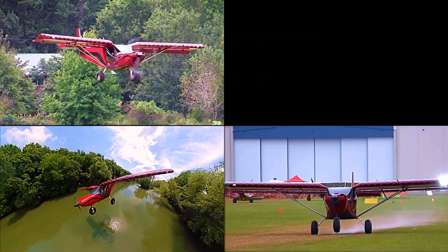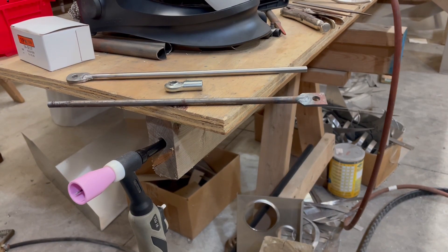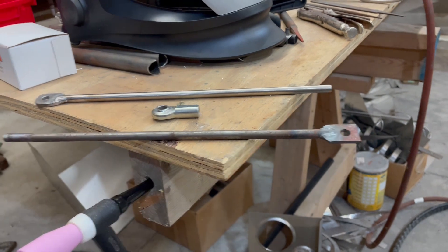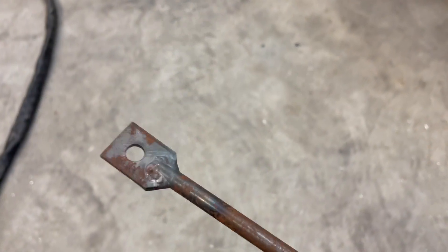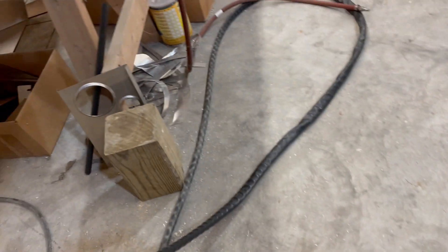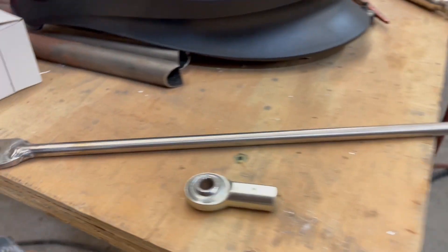Anyway, this specialty metal — let's take a look and see what I've got going on. Basically, this is a steering rod. There's one on each side of the front nose strut on the Zenith. From the factory it's a chromoly piece — it's got just an end welded on it where a bolt goes through, and then the other end is threaded to hold a bearing. That's what the stock setup is like.